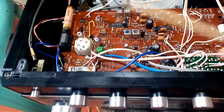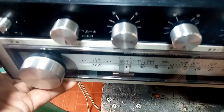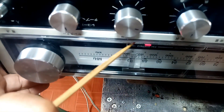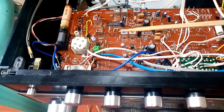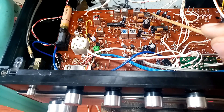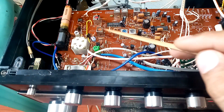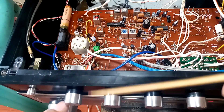The last step is to get the stereo signal. There is a trimmer for this — a small variable capacitor or coil. Some FM radios don't have it. Make sure you have already fine-tuned all the FM oscillator coils and the IF transformers first, then tune in to a clear channel before adjusting the stereo trimmer.